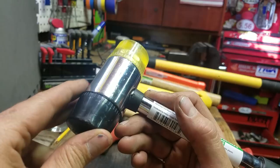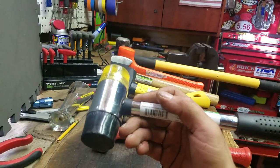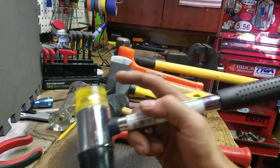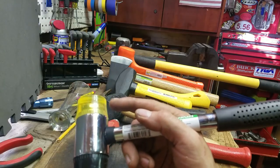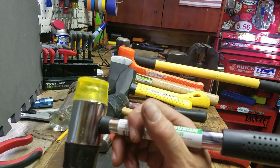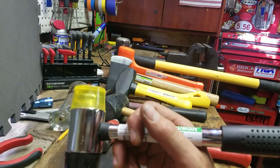I've actually used this to true up the grinding wheels on my bench grinder. I had a little thing hooked up trying to check the run-out and how much the wheel would wobble. When I'd find a high spot, I'd mark it with a Sharpie and then give it a couple taps with this. I kept doing that and actually got the thing balanced a lot better than it was just throwing the discs on there.